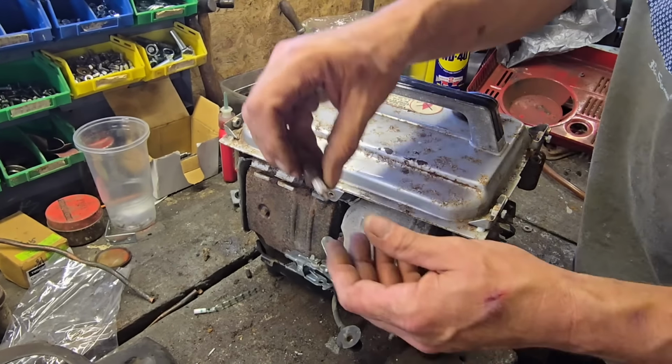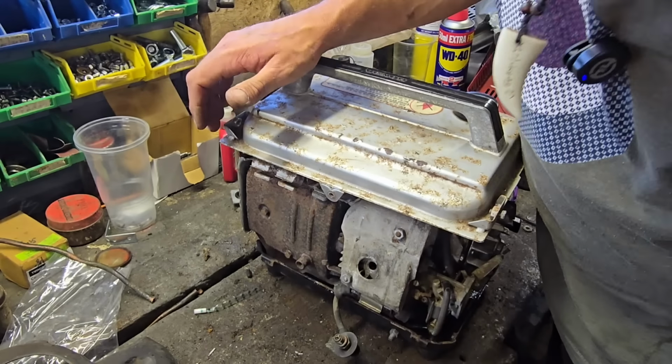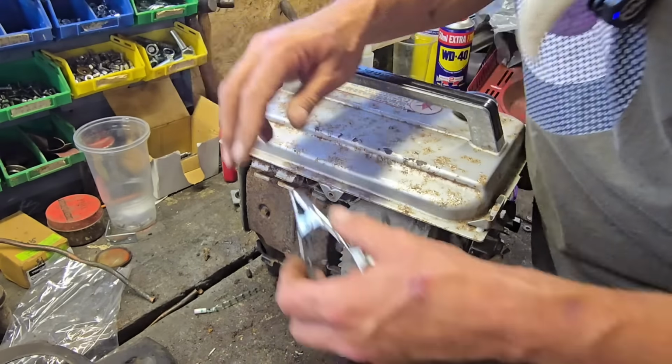Now, oh, we're off, that's right. No. Right, we have no sign of a spark still, guys. Why is that? Why has the old girl not got a spark? Have I not cleaned the plugs well enough? You never know. Points. Did I not give them points a good enough clean? Have with all my pulling a bit of oil sprayed up and got on them points, which has got them wet?